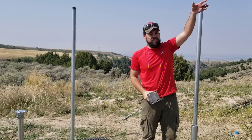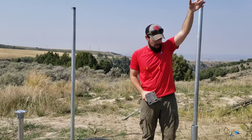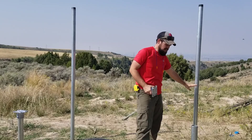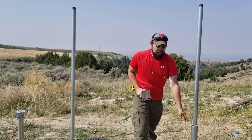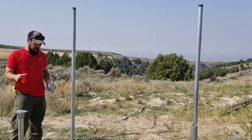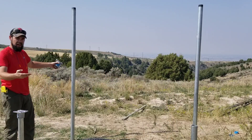The pipe was sitting up here five or six feet. We measured the distance here, measured down 54.5, got a level, put it right here, and that told us exactly what height we needed to cut. We're not on even ground, so we had to use the level. Everything's squared up and looking good.